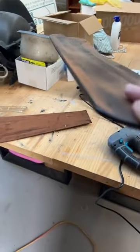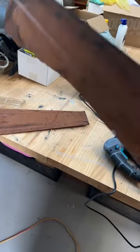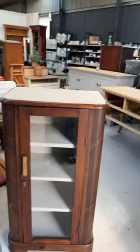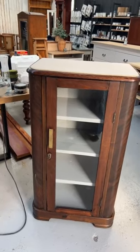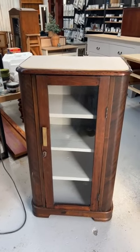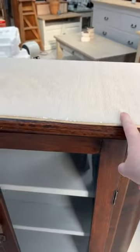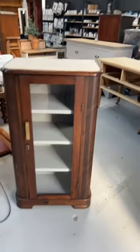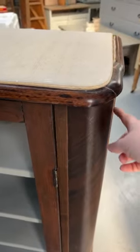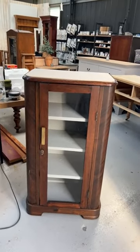The original top had a slight curve to it as well. It's some sort of ply or very similar timber — probably not ply, but with the ply you can see the different layers and then the veneer on top. Now we're going to match the stain — it's not going to be 100%, as you can see there are a lot of different timbers here. When they use a lot of different timbers, they pick a darker stain because it's more likely to hide the massive variations in colour. One timber here could be really red, another might be really light — like this door is pine.